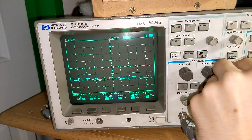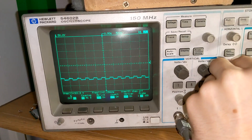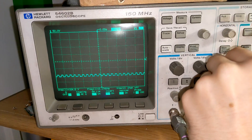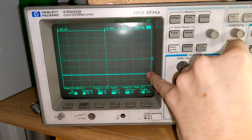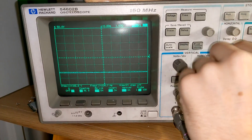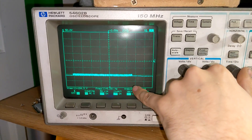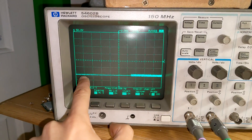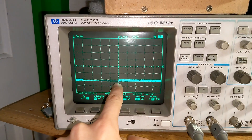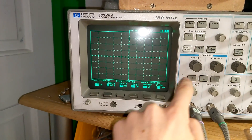PWM built instantly. Now let's keep pulsing the remote and see whether we get any more glitchiness. See how it's building beautifully every single time — there's not a single jump up to the top of the wave before it builds. It's building smoothly and beautifully every time. If we zoom right out to the slow scope view, you can see the start of this PWM is very clean every time — sharp every time — none of that DC bump before the PWM starts like you saw on trace memory.